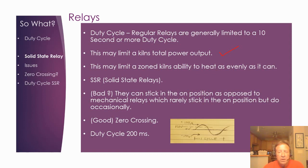Solid-state relays are pretty cool — they last longer and turn on and off quicker. They've been used in industry for many years, and now more and more people are converting from mechanical to solid-state because of the longevity. However, they do have one negative aspect: a solid-state relay can stick in the ON position about as often as in the OFF position when it fails. Mechanical relays rarely stick ON, but when any relay does stick ON in an electric kiln, the elements stay live — and that's a real issue.